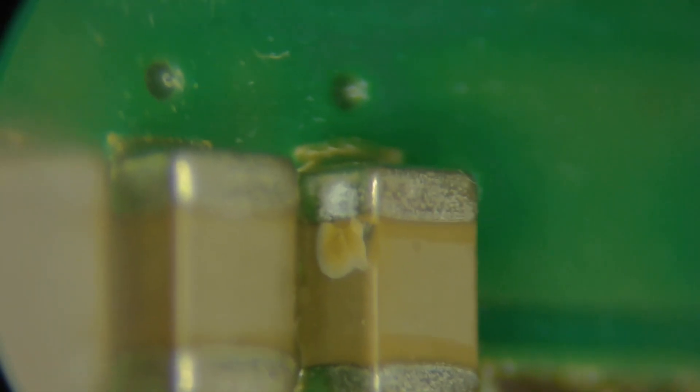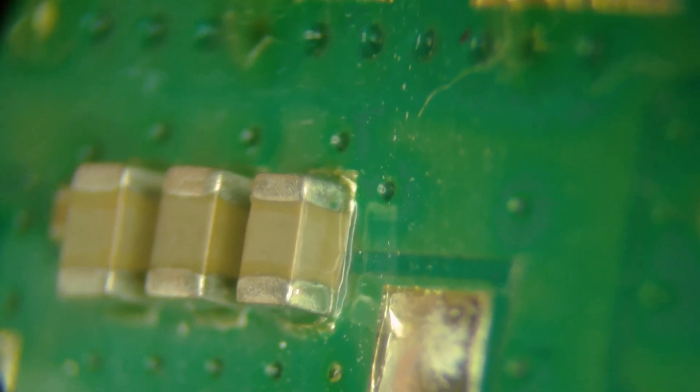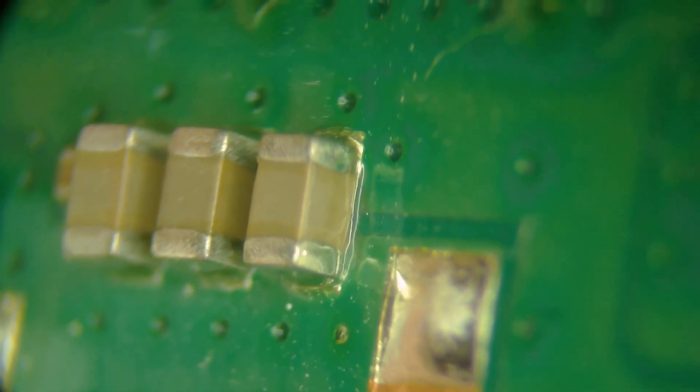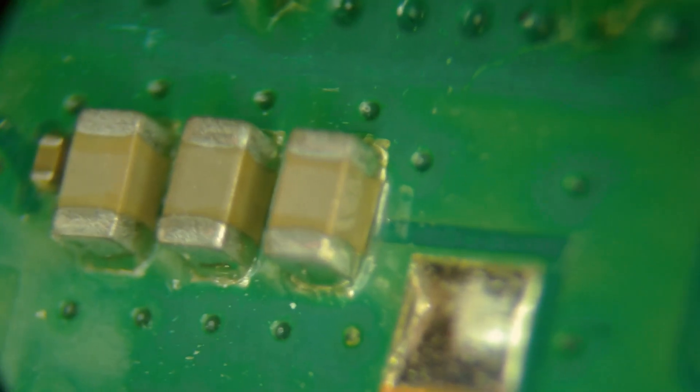You may not have absolutely needed a thermal camera to find this — you could have thoroughly inspected every single capacitor on this entire board to find this one that was burnt out. The capacitors are plentiful, and from one side this capacitor looks completely normal. Looking at it from that angle you would never know it was bad — no burn marks, no scorch marks around it. But from this direction, lo and behold, it is cracked.